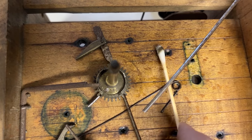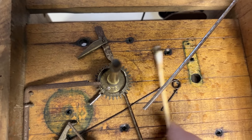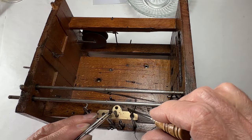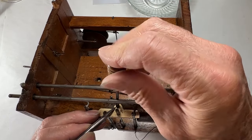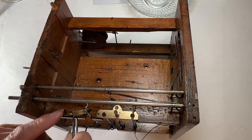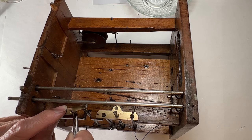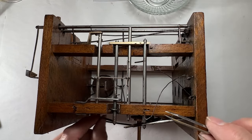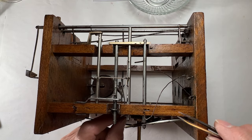Once it's all cleaned, I'll apply a clear tung oil — this will bring out the natural color of the wood, protect it from moisture swelling, and help with dirt and dust. I've removed all the items that were fastened with screws; items attached with nails and permanently fastened springs were left in place. There's no need to cause damage to the wood attempting to remove items not meant to be removed.